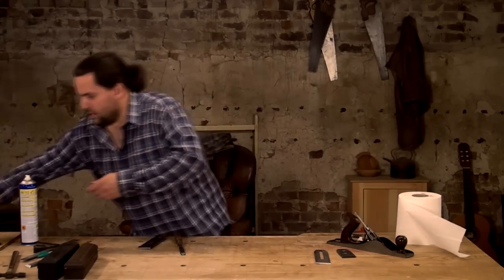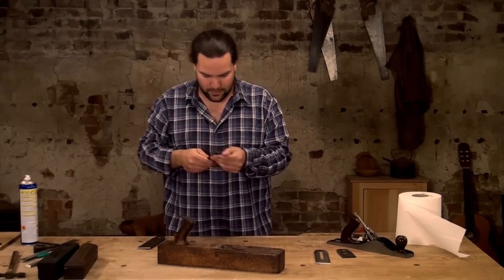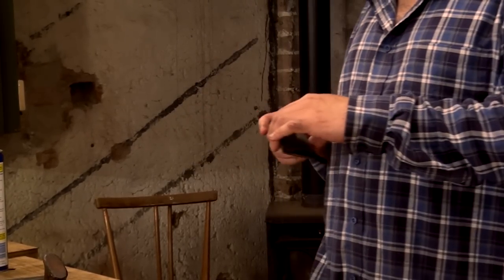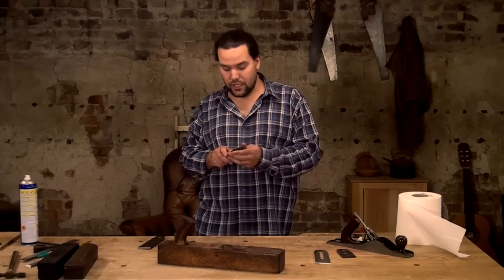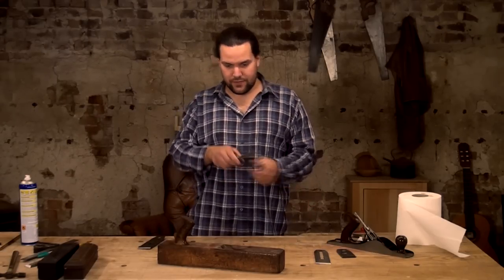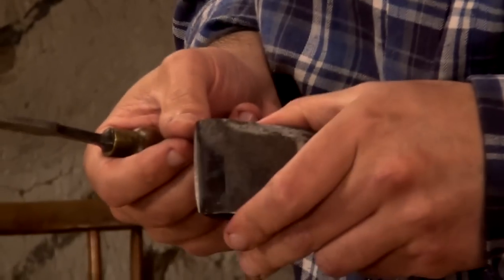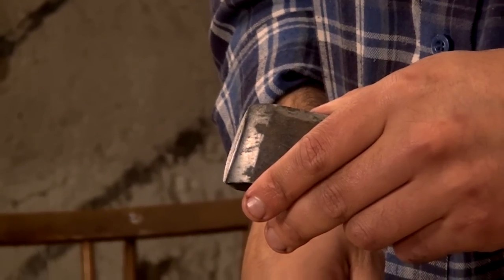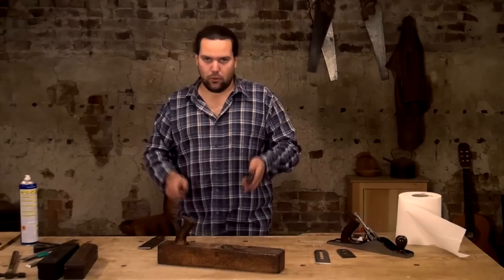This is a good hogging plane — you can see it's got a fairly good camber on there. And again, the cap is just thrown in; I'm not being precise on these thick things. I actually have planes with and without cap irons, because I personally find I'd rather get my iron out quicker and always have a keen edge, rather than trying to get a few more shavings out of a dull iron because the cap is reducing wear. But you can see here, I've just set it up to the corners — and again, that's optimised for its heaviest shaving.